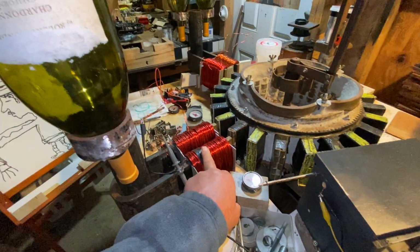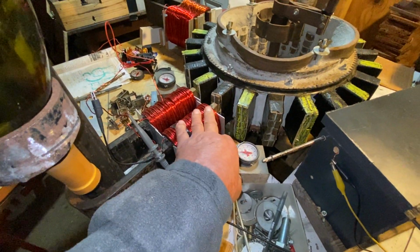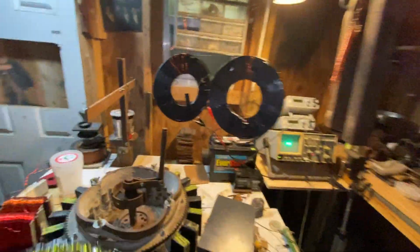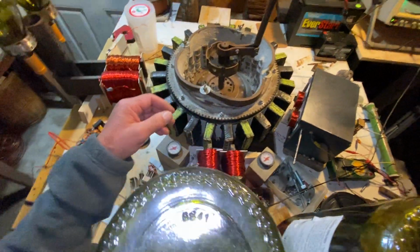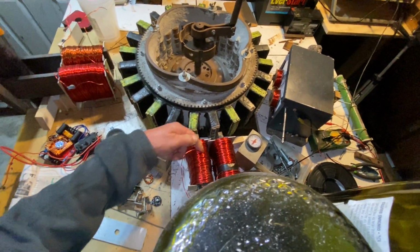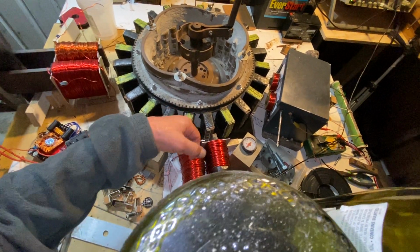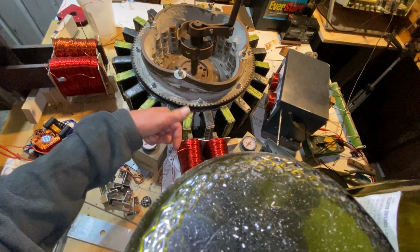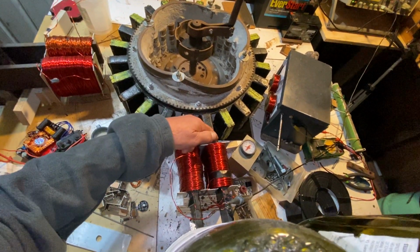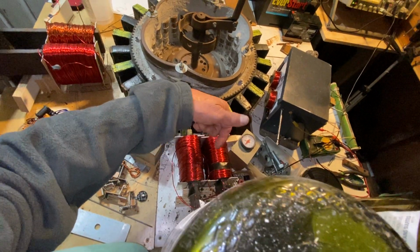So here, in the winding of these coils, this here goes clockwise and it makes a south pole. And then, let me see here. Let me verify that because, let me see. So this is turning clockwise. So no, to produce a north pole, I started off turning clockwise. To make a south pole, I started off going counterclockwise.